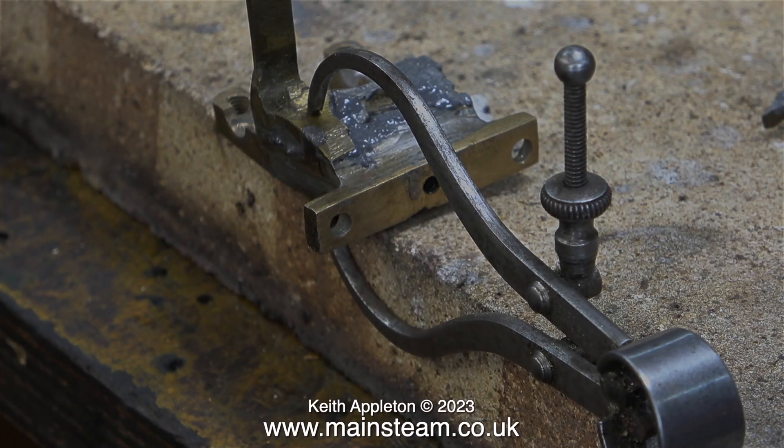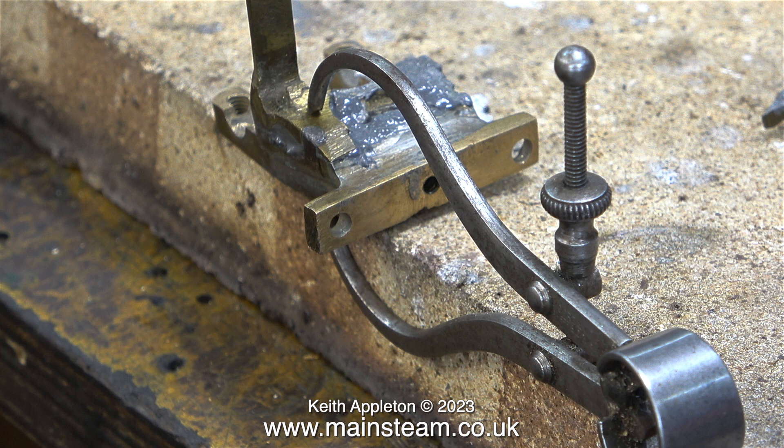Just a single solitary top tip. This is an antique caliper — it's very old and I've got a box full of them. In this case I'm using it as a clamp. As far as engineering accessories go these are still valid; I can still get very good accurate fits using one of these. But they have a good secondary function: they're an ideal clamp for holding parts together while soldering. I could use a proper engineer's clamp or a spring clamp, but this is better because the mass of metal touching the part being soldered is so small, and it will conduct negligible heat away from the joint.